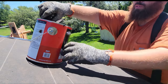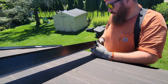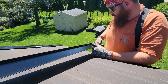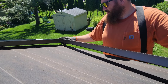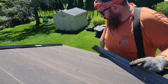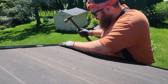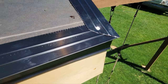Alright guys, so I got my roof cement — pretty thick, nasty stuff. Now hold on, there's more you got to do before you can start roofing. So this right here that I'm cutting out is the drip edge. I'm putting it on the bottom as well as the rake or gable end of the roof. These pieces have to go on. You don't have to use a drip edge — there are all sorts of other profiles and the internet has great how-tos. I'm not going to show how I cut and trim mine since there's a lot of information out there on how to make all these pieces fit together great.